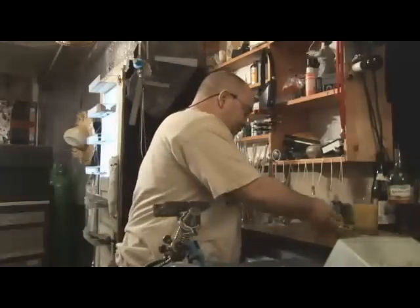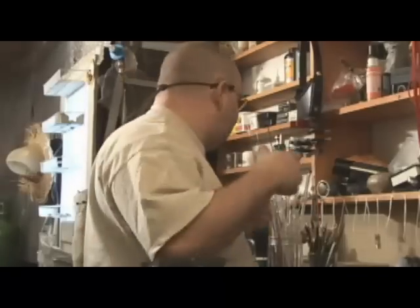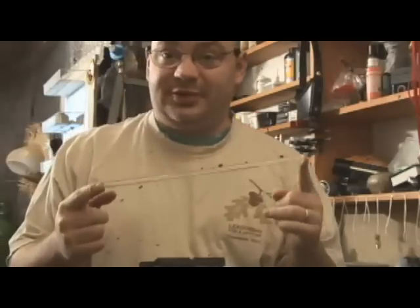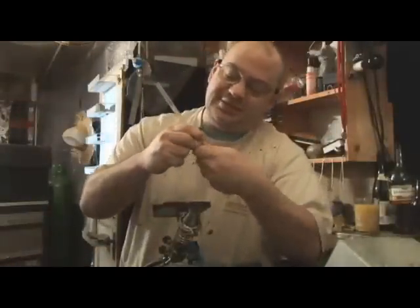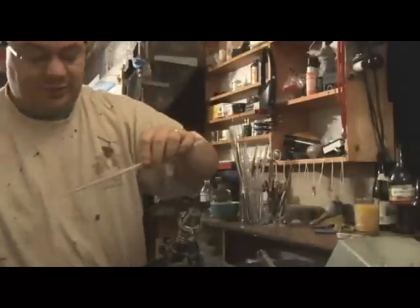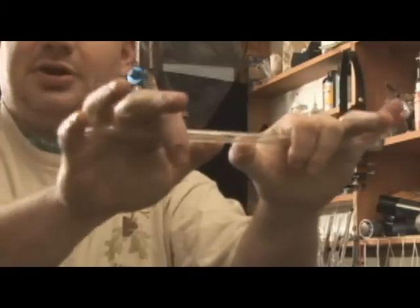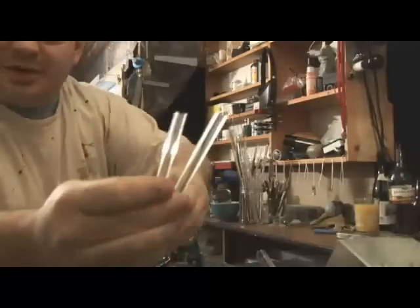For those that are not always blowing glass, you might think to yourself, well, cutting tubing — it can't be that hard, there's got to be a special tool or something. And there are in fact ways to get the job done, particularly on small tube. This is like 10 millimeter — you can see this really teeny stuff. On this, all the way up to about 12 to 15 millimeter, one of the easiest things to do is get a good score — now you can hear it — wet the score, place your thumbs on either side where the score is, about 180 degrees opposite the score on the glass tube, and then apply force this way. And it will snap off a very clean line.